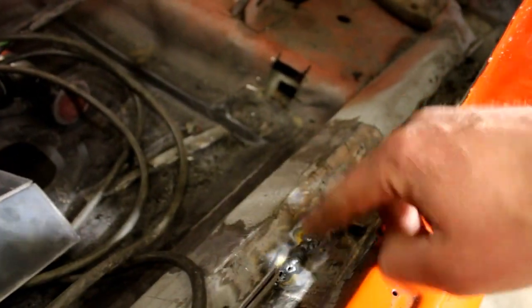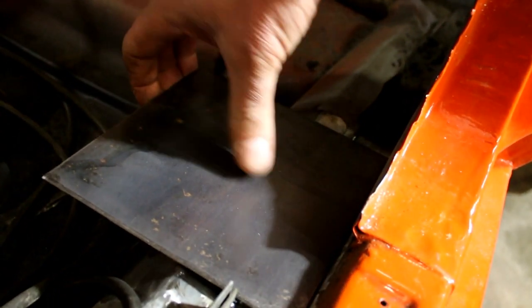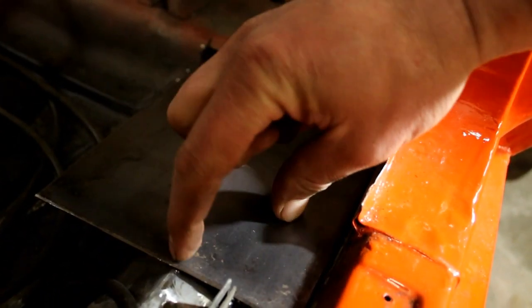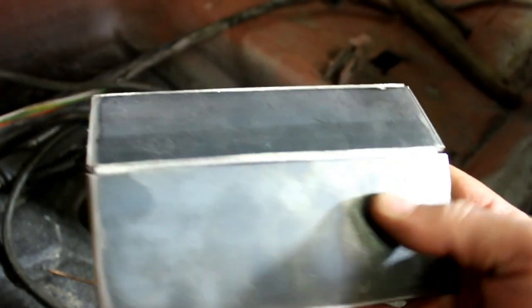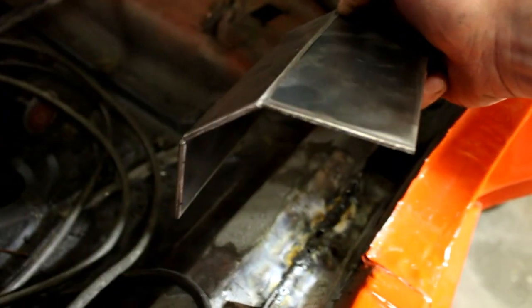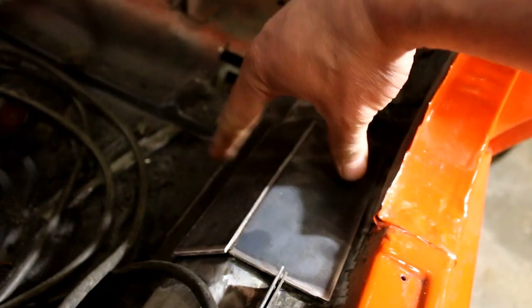Now the next problem, after you've got this cut, and I'm going to weld and grind this nice and smooth, is that you've got a flat plate. The flat plate is obviously not going to fit that octagonal rocker, right? So I put the plate in, made a couple marks, and relief cut this piece of steel. This is 1/8 inch steel, I think. I went ahead and bent it after I made my mark. Obviously those aren't going to stay there. I'm going to weld those solid and shut